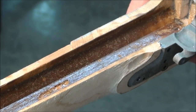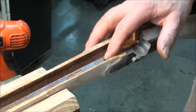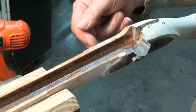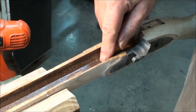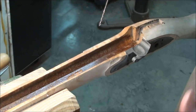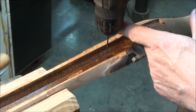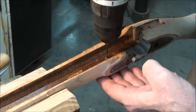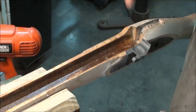The first thing we want to do before we set in the side plate is find out where the ramrod channel actually goes through under here, so we make sure the bolt doesn't go through the channel causing problems with the ramrod. Some of these pre-shaped stocks you'll see a small hole where somebody's already checked it when they were running the stock. But basically it's just drill a hole — I use a 5/64 — drill down until you feel it pop through and hit the bottom of the ramrod channel. Stop. Don't go out the bottom of the gun.